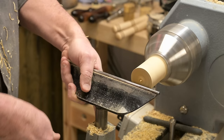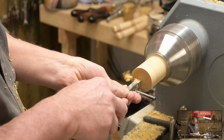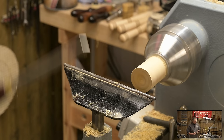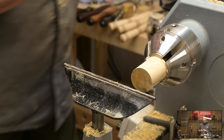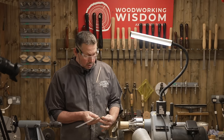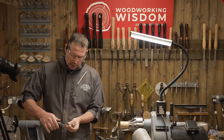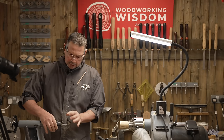Let's clean that surface — the only reason I'm cleaning it is because we're going to drill in a minute. There we go. We might as well go straight into the drilling. I've already got my drill chuck in the lathe. I'm using a sawtooth Forstner bit — this one is around 30 millimeters in diameter. For depth, I'm going to take the depth reading from the shaker I've already done and keep them the same.